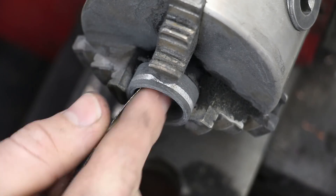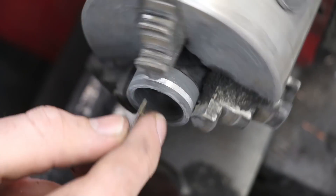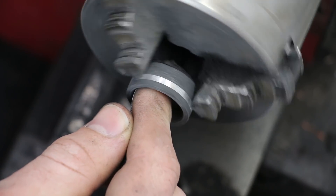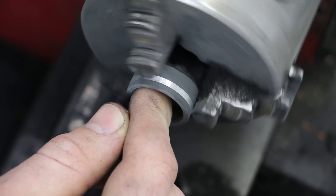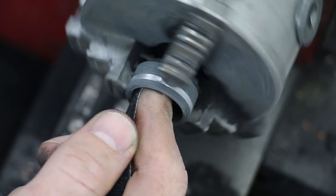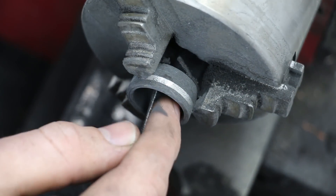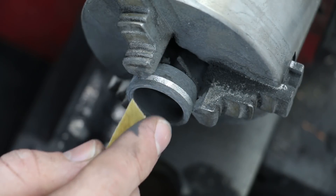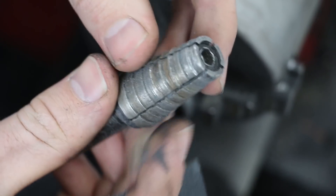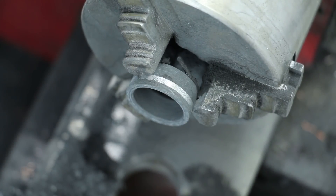I think a satin finish will make this look more like a higher quality product rather than a polished plasticky look. I'll just take the sandpaper strip, put my finger in here, and have the lathe turning really slowly. I always speed up the footage and get comments saying I'm being super dangerous and going to get my finger ripped off, but I'm going slowly and I've got my finger on the power button. If you're doing this yourself, do not turn it up to full speed. Once I'm done with the inside, I'm going to pop it back on the expanding ring mandrel, coat it in electrical tape to protect the inside since we just sanded it, and then it'll be finished.